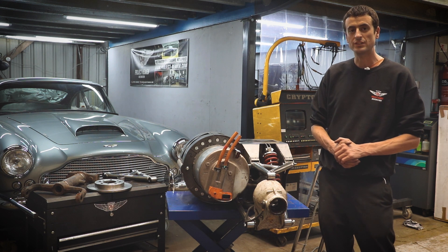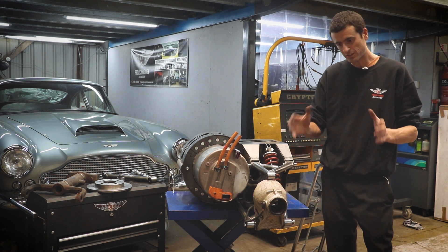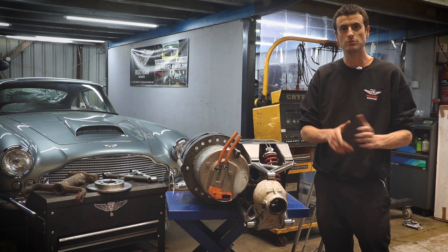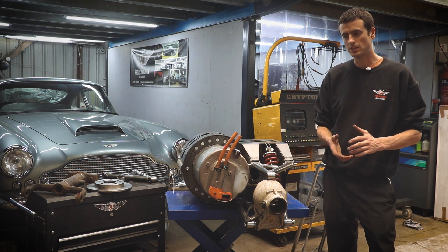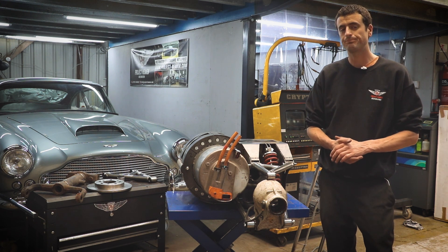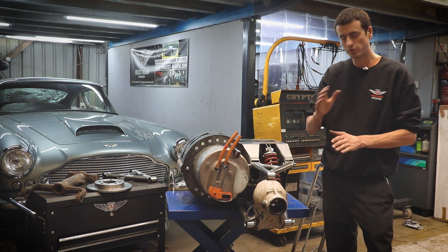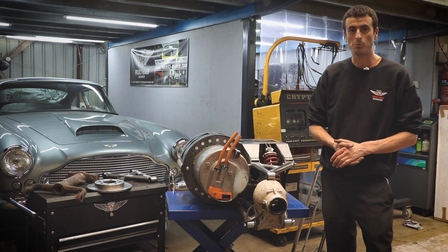The reason for doing that was to measure the roll centre location of that suspension unit. Every car has a roll centre — if you were to roll the car, that's the point at which there is no movement, the centre of its rotation. Every car also has a centre of mass, front and back. If the centre of mass is above the centre of rotation, then when you corner the car will roll, which obviously is what most cars do.